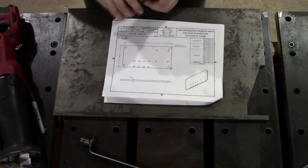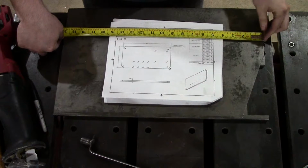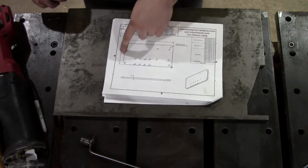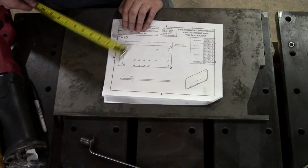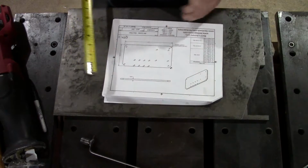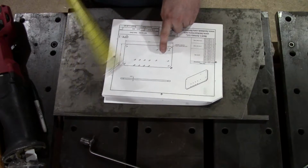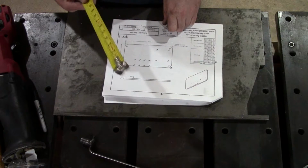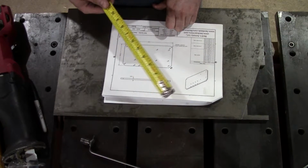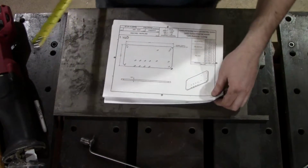So you can see I'm a little short here. Let's see, what do I got? Okay, I do have 20 inches, but the front's cut off. So clearly this has to be the front because up here I've got a notch taken out. So I'm just gonna take this one rubber foot and I'm gonna move it back here somewhere, okay? And you could do the same thing. This is my motor bolt pattern, mounting pattern. So if yours is different, the C holes will need to be changed to match your motor. Now these, the A holes, they will need to match the print because there is another drawing that bolts on there. So let's go ahead and start laying this out.